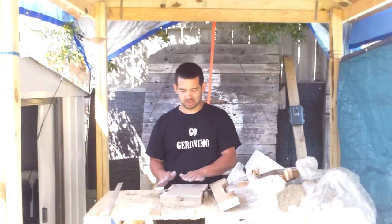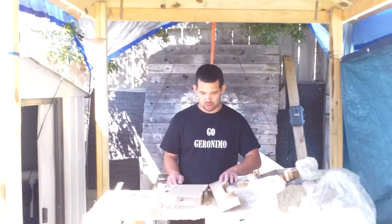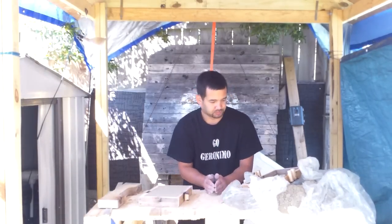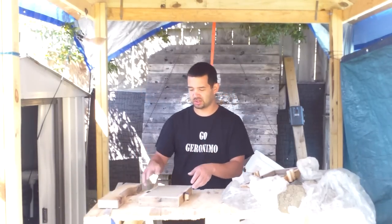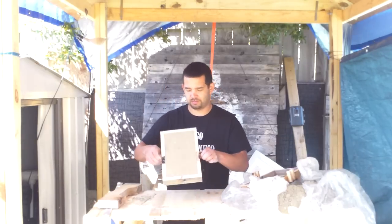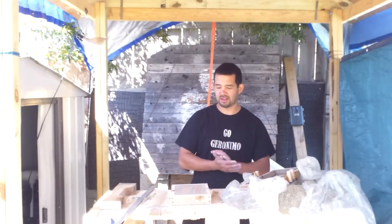You want to get it nice and level, because when you put this on its back this is actually gonna go into the bottom where the table is. If it's not level your sand's gonna shift over time and it's gonna cause the mold to mess up. But now that you've packed the sand down — it's a moist sand and you packed it together, with the clay also being in there — you can actually just pick it up and turn it around. Now the templates are facing upwards.